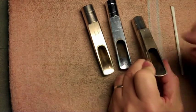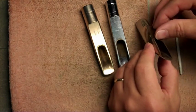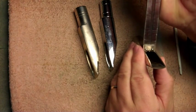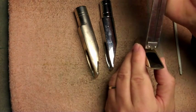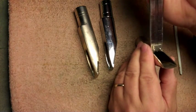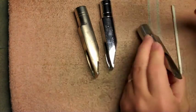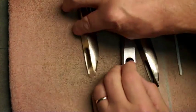The caps are in different thicknesses — I don't know if that's part of the spec or just production variation. This one here is about 30 thousandths thick; it's not a great way to measure it, but you can get an idea by dropping the end of your caliper probe down there. It's around 30 thousandths. This one — the Guy Hawkins — is a little thicker, around 50 thousandths.